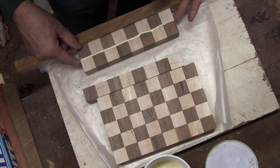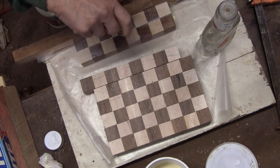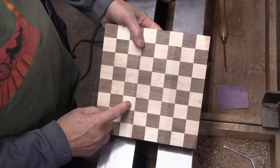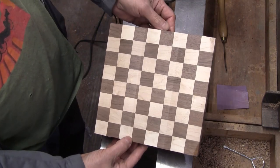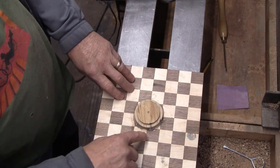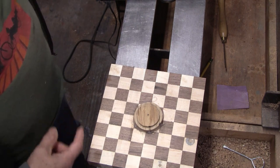I'll get some water and wipe this off. By the time I do all that, it'll be time to put clamps on. I've got it all cleaned up — it's eight and seven-eighths square and the blocks are an inch and an eighth thick. I'm only going to cut one ring out of this because I want to try to maintain that look. I've got a tenon hot glued onto this block and they hold quite well. I'll put a link in the description for Gord Rock's channel because I think that's where I picked up that trick. He does it on lots of things and I've done it on pieces way bigger than this, so I trust it. Let me get that mounted up and we'll cut one ring on it and get it glued together.